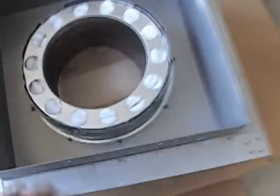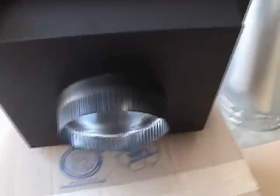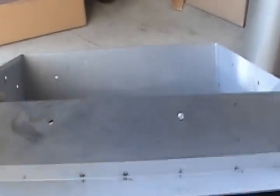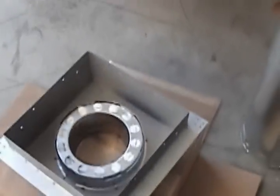The first thing to show is the support box. On the bottom you have the connector for your single wall stove pipe — anything black will be exposed. The bare metal part gets nailed into the framing of your house. You cut a hole that's twelve and a half by twelve and a half inches; it has pre-drilled holes for nailing or screwing. Trim it out with two-by-fours — this ceiling support box supports the weight of the chimney pipe, so get it nicely secured on all four sides.